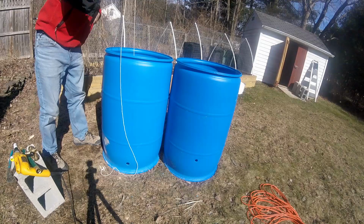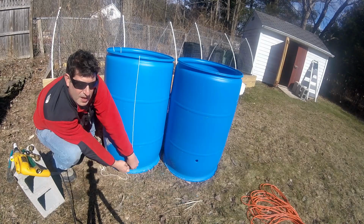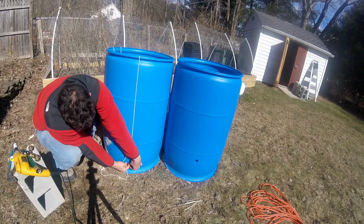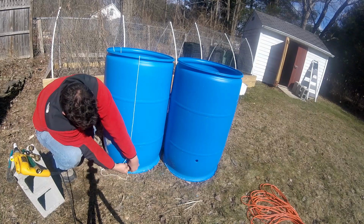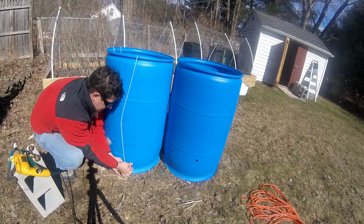The other key thing on this particular part is this is sort of a double setup. You put this whole bushing on the front and then this bulkhead fitting on, and we put the spigot inside it, so it actually gets threaded backwards. So the whole lefty-loosey, righty-tighty thing. This one you actually have to spin on the wrong way to make it catch. I'll use a pair of slip joints just to get it tight.